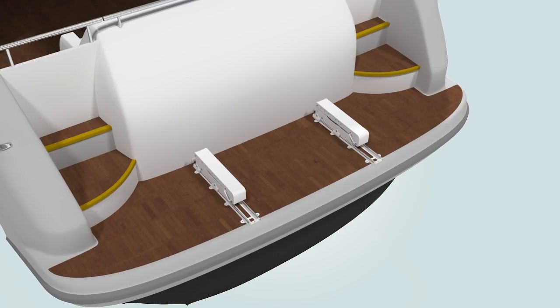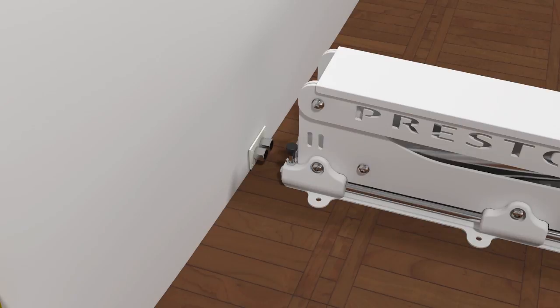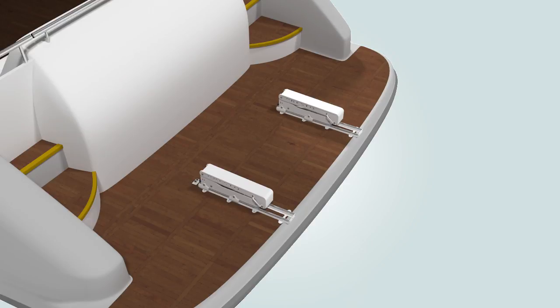A small platform with weight limitations at the stern will require the PWC's weight to be centered as closely as possible to the transom, as in Alternative 1. With a longer swim platform, and if there are no weight issues at the stern, use Alternative 2 to free up more space.